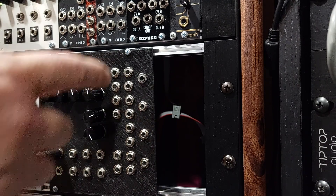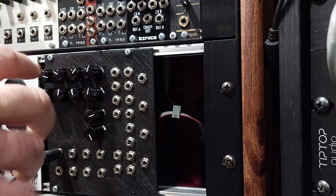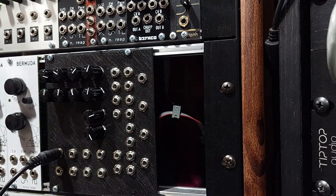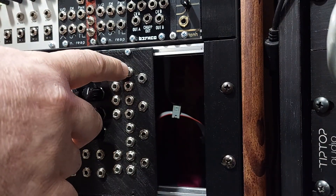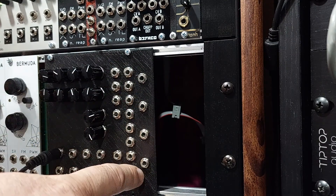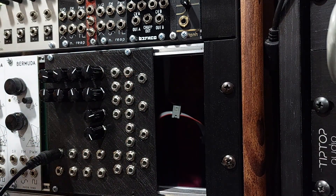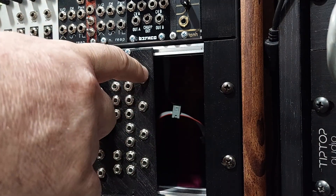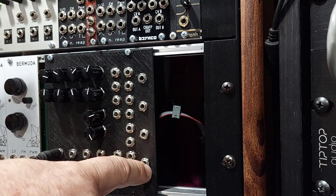The interesting part over here is that, in previous versions and in this one, CMOS is used to kind of smash the oscillators together and give you these crazy outputs. What you have here is logic inputs and then combined logic outputs. What logic operation it is I'm not 100% certain. On the schematic it's got 1, 2, 3, 4, etc., and then this is 1 plus 2, 3 plus 4, 5 plus 6, and 7 plus 8.